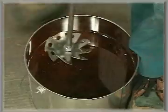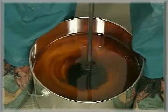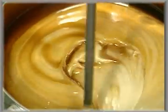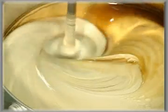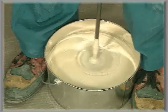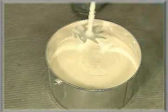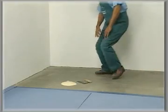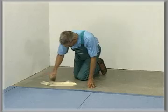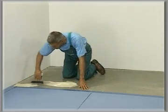You can also use dispersion adhesives instead of a two-component PU adhesive, provided certain preconditions are met and after consultation with the adhesive manufacturer. The processing of such dispersion adhesives corresponds to that described below for PU fixing. Apply the adhesive continuously with an A2 serration.